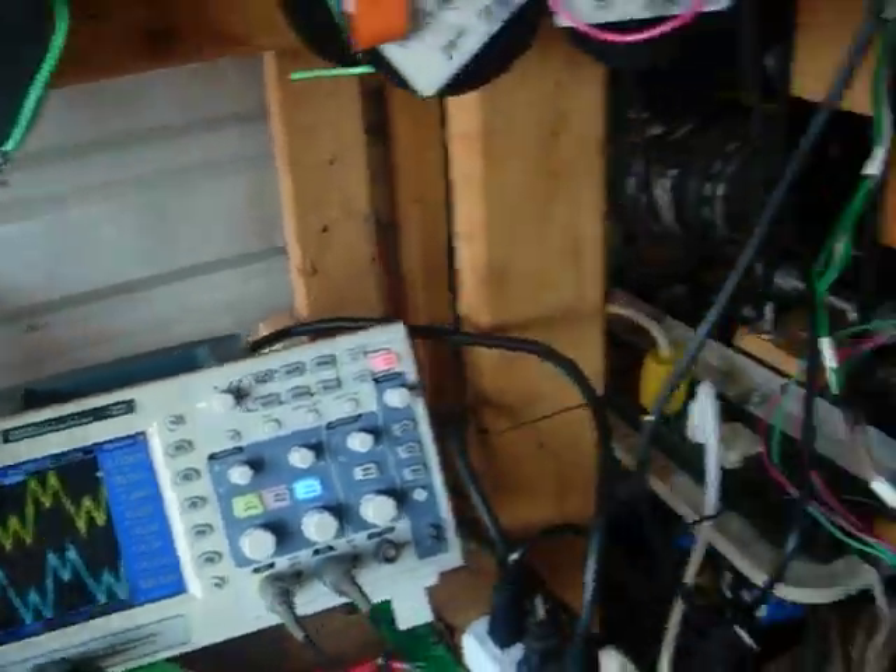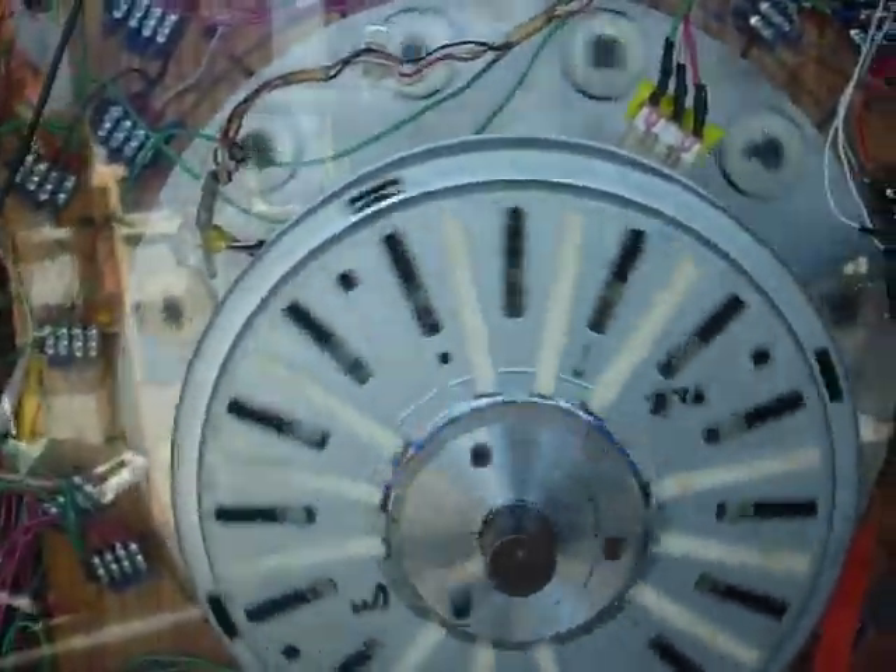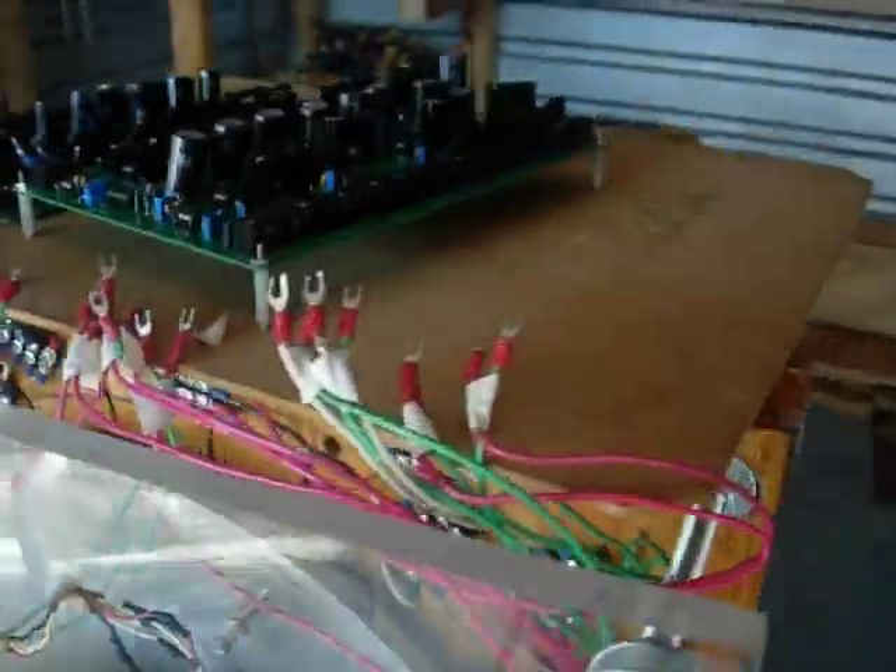Hopefully get my 170 milliamps to run this beast. Let's turn it off — I can just turn the pot down, and now there's no power to the motor at all. But the amount of mass in here with the rotors means it keeps spinning for a while. I've got three magnetic rotors and two sets of coils, so there are 96 coils total.